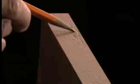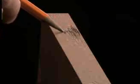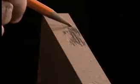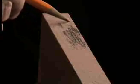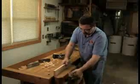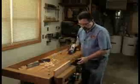I'm going to just color in this area with pencil. That way my pencil is actually coloring in some of the tear out down at the bottom. And then I'll do a couple more cuts with the grain, and you'll see how the pencil stays there because it's ripped out so deep. Okay, so I'm going to turn it around again to plane with the grain and just plane that edge again.